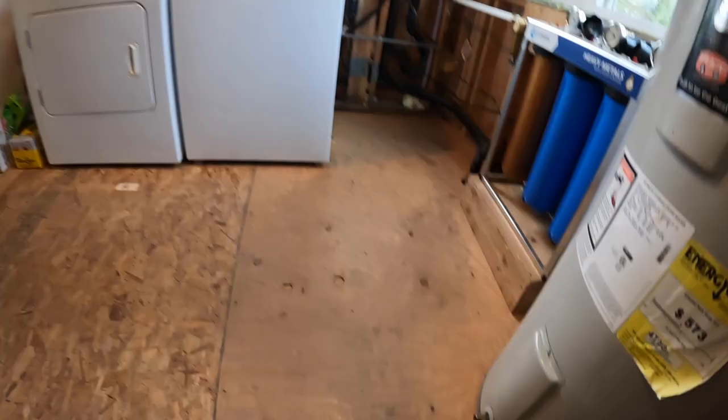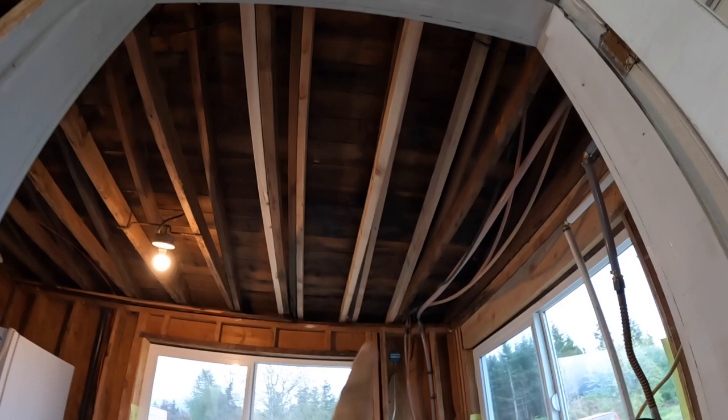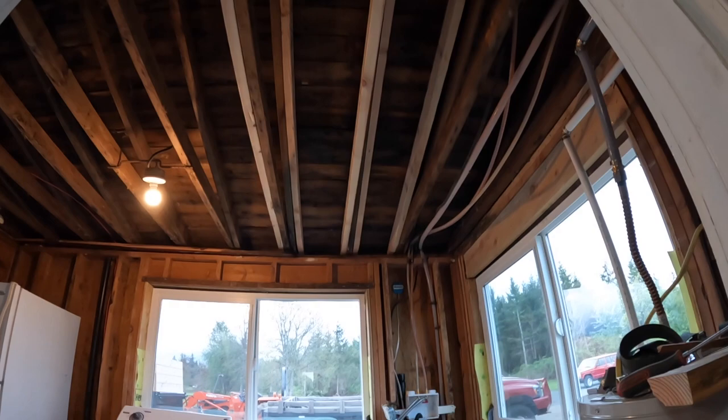I also left off saying that we still had seen some rafters that needed to get replaced. They were old rotten ones. So as you guys can see, got the new rafters in place. It wasn't too many of them, but it's a tight fit with the roof being on. It's a lot harder to replace the rafters, but we got those in, whether they're scabbed on like this one or brand new rafters entirely. Looking good, much more solid. Don't have to worry about that rot anymore.